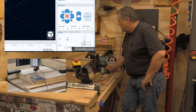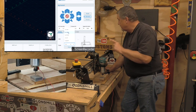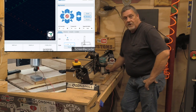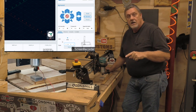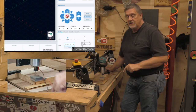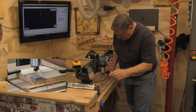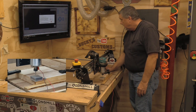I'm going to do all three. Very important: you have to tell it what size bit you have, because if you don't it's not going to probe correctly. What I've got in this mill right now is an eighth-inch compression bit, which you can find at the CNC Labs store — I'll leave a link below. I'm going to go to 0.125, that's my eighth inch, and once I have that done, everything's connected, and I hit probe.